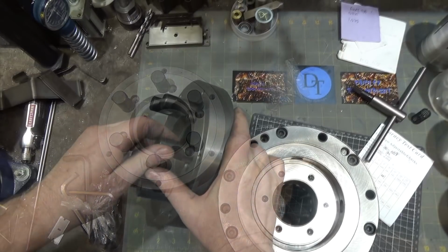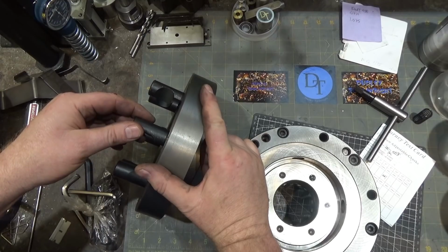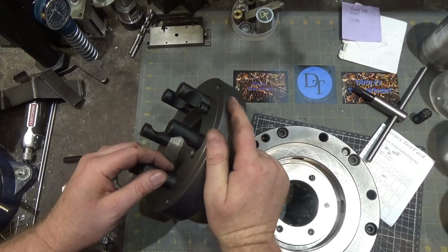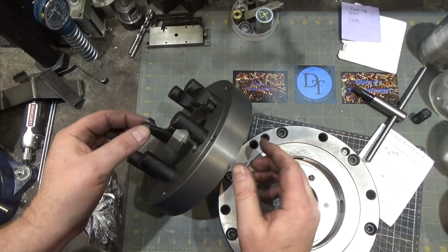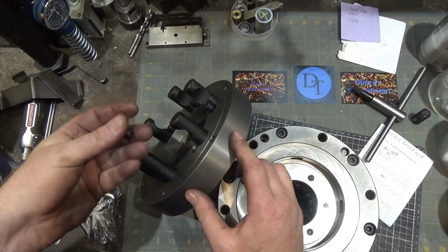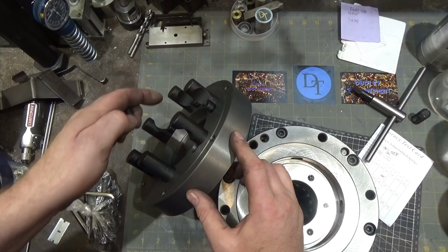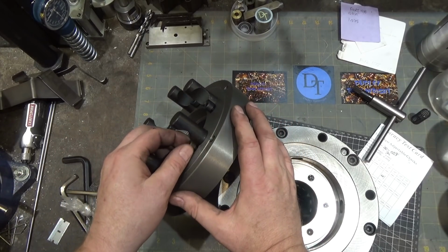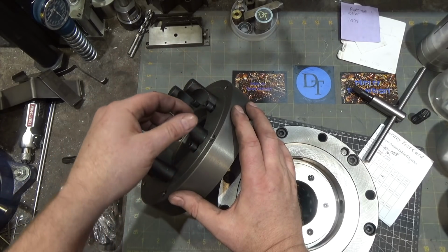I'll be right back. One pitfall when you put these in, just so you know, so there's a line on these, and on mine it turns out that when you face the D in the proper direction so that it lines up with the set screws, it seems like it's about right, at least on a couple of them, and I couldn't get the other ones. I thought, that's weird, so I went a full turn, and that was too much. And then I realized, without these locking screws, when you're trying to tighten down on it, these might turn a little bit, in which case they won't lock. So you may have to put in the locking screws, try it, and then if that doesn't work, work from there. So I am going to lock these guys down in place because they're not very snug.